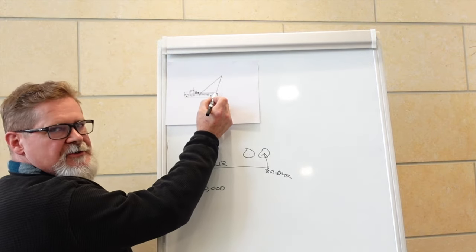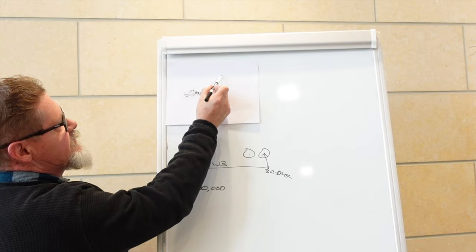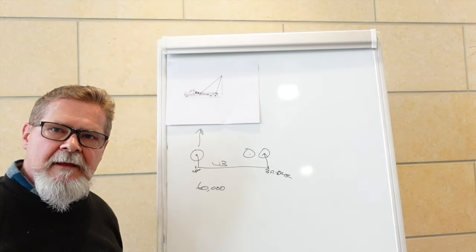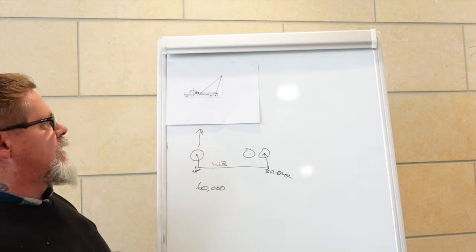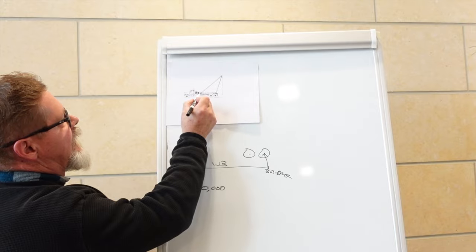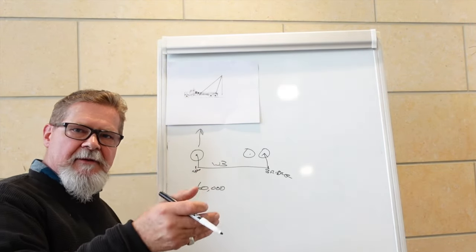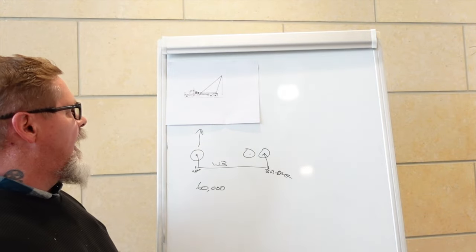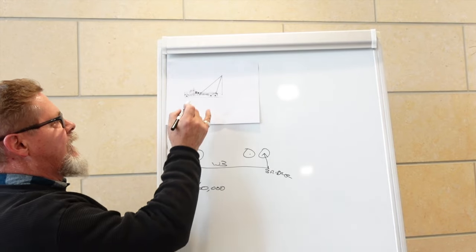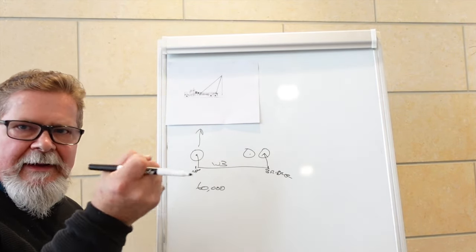there's a very large pulley right here. There is a large pulley here. There's a series of pulleys here. So the main winch, the truck winch, is right here. There is another one under here and another one off to the side. The picking capacities of those winches follow that hierarchy. This is typically a Tulsa 80 or a Tulsa 100 winch, which relates to its capacity and pulling of tons or hoisting of tons.